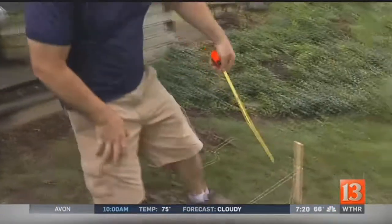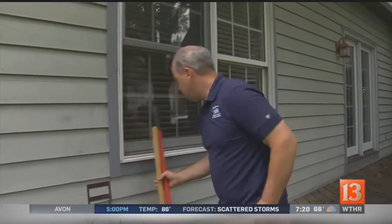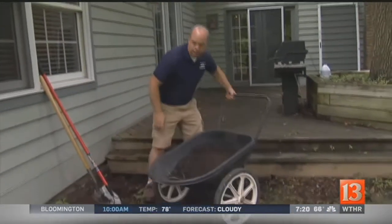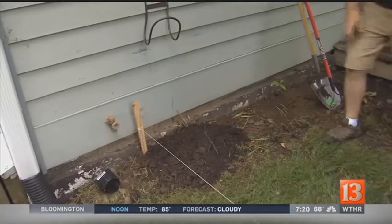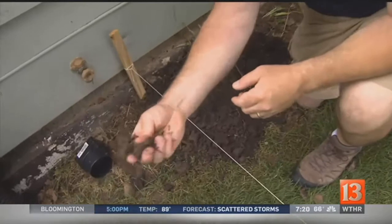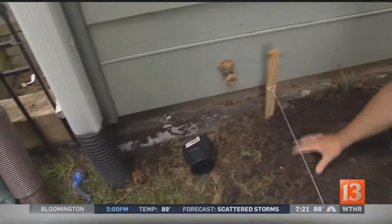At the end of the ten-foot span, Ted is at eleven and a half inches — we need about two and a half inches of fall. To fix this, you want to get some fill dirt. Don't use just stuff from a bag — I've got fill dirt here that has some clay in it, and that's what you want up around the foundation, so everything is sloping away.